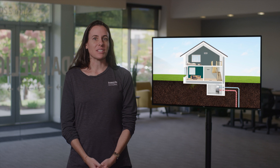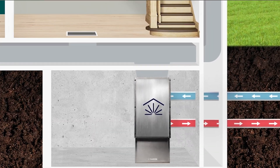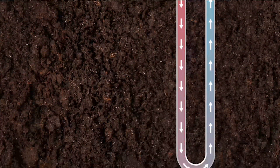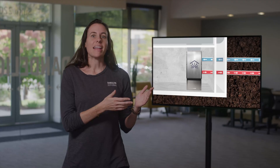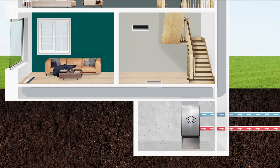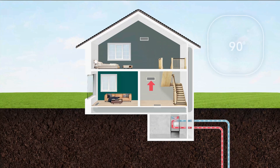Now let's get into a little more detail about how the system works. We'll start with summer, when it's hot outside and you want to keep your house nice and cool. During the summer months, the heat pump takes heat out of the air inside your home and transfers that heat into the water that then circulates through the ground loop. As that now warm water is pumped through the ground loop, it's cooled by the 55-degree ground. In other words, that heat is seeping through the ground loop into the surrounding earth, thereby cooling that water. So now the colder water can circulate back to the heat pump, and that heat pump is then able to take even more heat out of your house and put that heat into the water, warming it up again. Then that warmed water is sent back to the ground loop to cool it down, and the cycle continues until the home reaches the desired temperature.